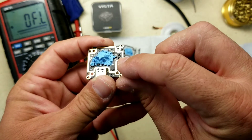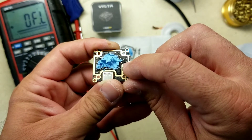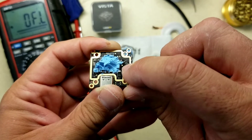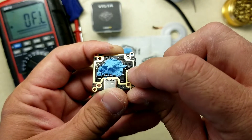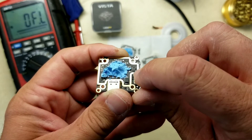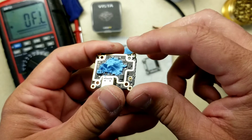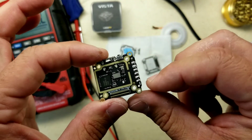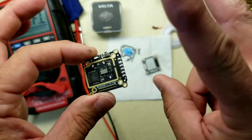You can see the little diode again — RX is the first one, TX is the second one, and SBUS is the third one. I personally don't ever use their receiver so I've never really seen an issue with that. I'm repairing this for somebody else. So it's RX then TX — we blew the RX diode and the TX diode. What we did was remove the RX diode, and that's why we didn't have continuity between ground and the first one.